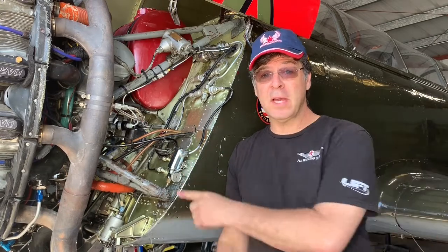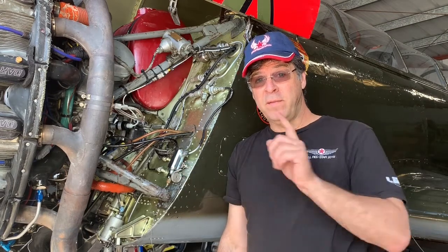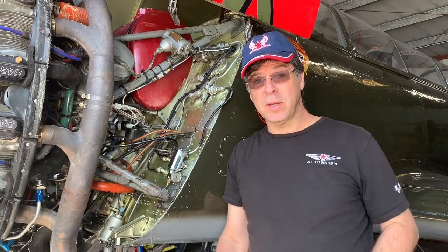So as is often the case, we did not have a problem with the compressor. The compressor probably works fine, but we did have a leak from the banjo fitting. And oftentimes we'll find leaks again on this snot bottle. Fix those before looking at your compressor.